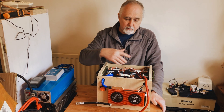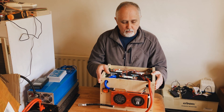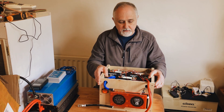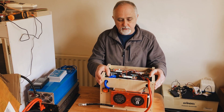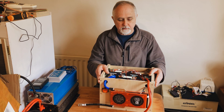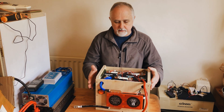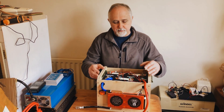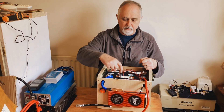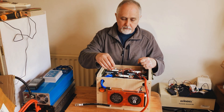We did the top balancing with the battery in its compressed enclosure. We wanted to avoid the swelling that happens naturally when these cells reach their full state of charge right from the start, so these have never been charged without their enclosure. In theory, that means they will last about a thousand cycles more, since the enclosure stops them from expanding and contracting, which causes stress on the terminals and, more importantly, delamination of the terminals inside.